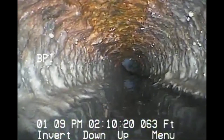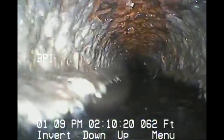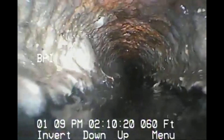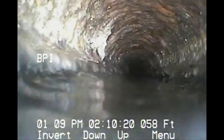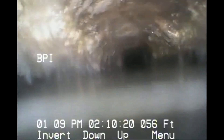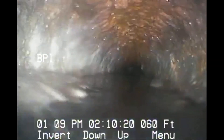That's as far as we can get. Now it looks like we're starting to come back out. You can see how oxidized it is. Potentially, it could catch toilet paper and hang up on the walls. The orangeburg is always a giveaway that it should be replaced, or at least know that it could need replacement in the future.